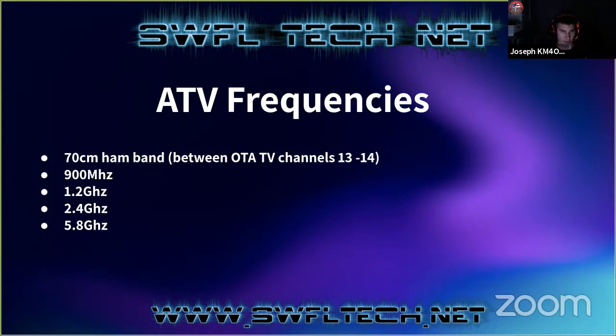You can get them in little modules that are about this big, and they cost about $100 for a receiver and a transmitter. 900 megahertz is pretty much the lowest that you can actually find transmitters for. I have yet to find a 70 centimeter transmitter. 1.2 gigahertz is another one. There's benefits and drawbacks to each band.